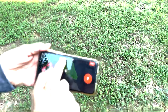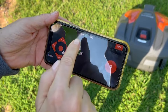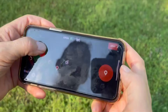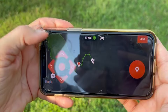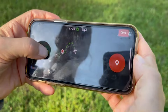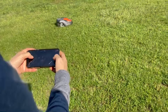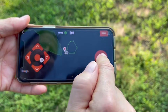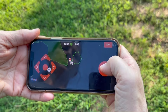You see the EPOS has now turned green. This is the little button you hit every time you want a waypoint. I've got it — the reference station is green. So I'm going to go ahead and drop a pin, and you see the little bubble came up — that means a waypoint has been established. As it goes around, it won't draw the line. See, I'm going to go straight for a while — there's no line on the screen. But once I do a waypoint, there's the line — did you see that? Once you complete it, each little dot I hit this button and those little dots are waypoints. You need at least three to establish a work area. So when I did this before, I didn't click that.